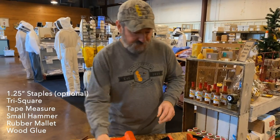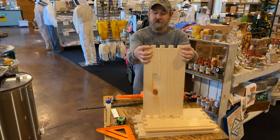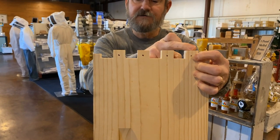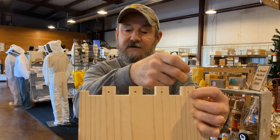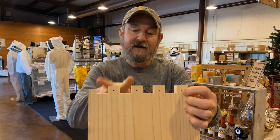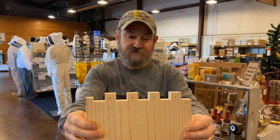These commercial supers — select grade supers — most all boxes come with a pre-drilled eighth-inch hole in the ears. They do that so that you have a starting point. You're hitting the centers of these ears, which makes sure that you're not splitting out if you have any gap in the boxes between the ears for the finished fit.